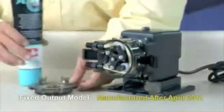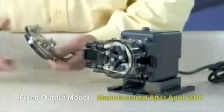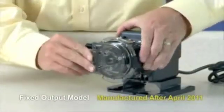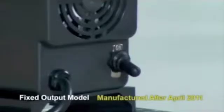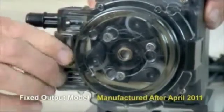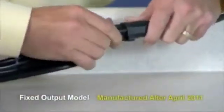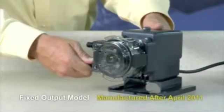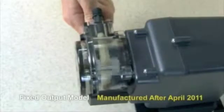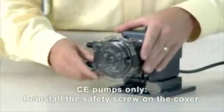Apply a small amount of AquaShield to the cover bushing only. Do not lubricate the pump tube. Place the tube housing cover feet first on the tube housing. Affix the front of the latches to the cover lip and then press the latches back to secure. To center the tube, ensure the pump is off. Lift the latch located between the tube fittings, leaving the end of the latch engaged with the lip on the tube housing cover. Leave the latch on the opposite side engaged. Plug the pump in and turn it on. Turn the tube fitting on the suction side not more than one eighth of a turn in the direction the tube must move. Do not let go of the fitting until the tube rides approximately in the center of the rollers. Turn the pump off, let go of the fitting, and secure the latch between the fittings.